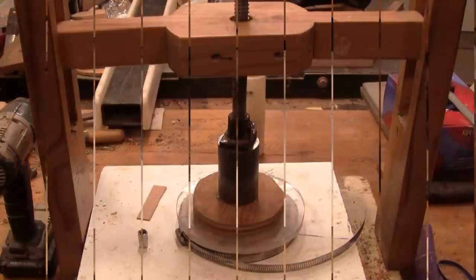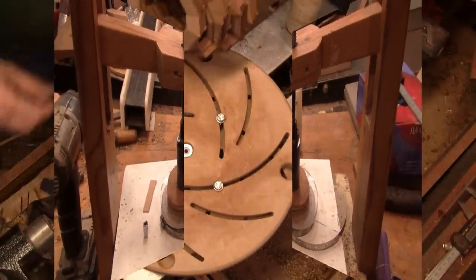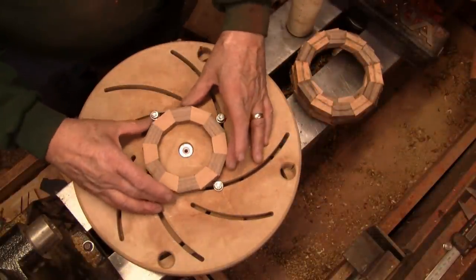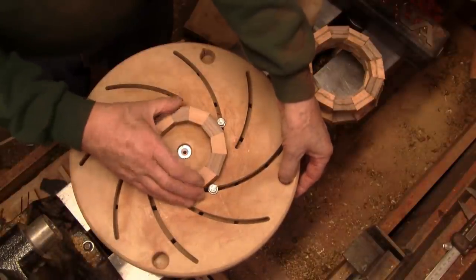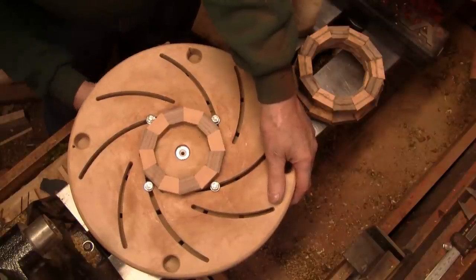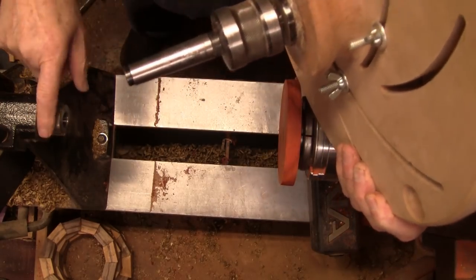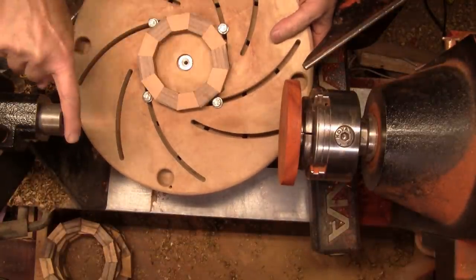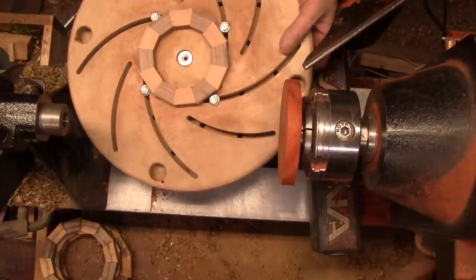Here's a better view of the glue press. I'll let this one sit for a while, get the other ones glued up, and tomorrow we'll start building something out of them. I've got all the rings glued up and I have my Longworth chuck here that I made — the only thing I use it for is centering rings to glue them in place while it's in the lathe. I'll get this clamp down so it doesn't move. On the back side I have a ball bearing arbor that fits in the tail stock. I'll go ahead and get glue on the face, slide it up, and clamp it up tight. Let it sit until the glue sets up and then we'll do the next ring.